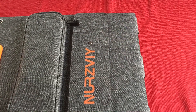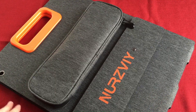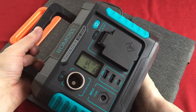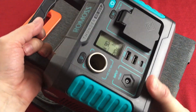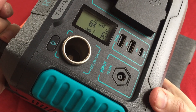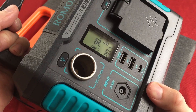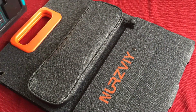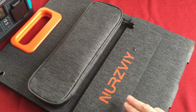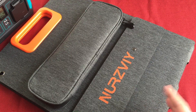This produces 80 watts peak power, which will charge the power station nicely. The Romos RS300 accepts 12 to 28 volts. The open circuit voltage of this panel is 21.6 volts without a load — make sure your device or charge controller can handle that. Short circuit current is 4.69 amps. You position the panels perpendicular to sunlight for the best charge. In my outdoor test, I got about 40 watts max with an evening winter sun — fluctuating between 20 to 40 watts — which was still pretty nice.